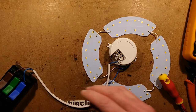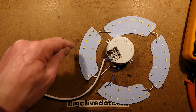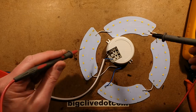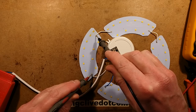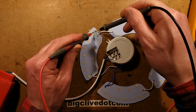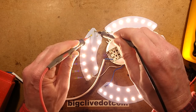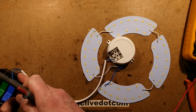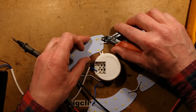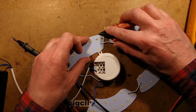Let's power this up and see what happens. Nothing. So let's bridge out this whole circuit board with the meter set to the 10 amp range again. Keep in mind this is all live - effectively at mains voltage. Yeah, the fault is definitely on that circuit board. That LED has just popped off - yeah, it's those two LEDs that have killed it. So technically speaking, if I bridged out those two LED positions that would give it a new lease of life. I'll disconnect the power. When you just take your pliers and slice the LEDs off it kind of exposes the solder underneath quite well.